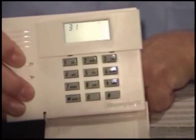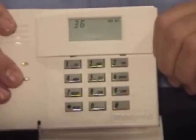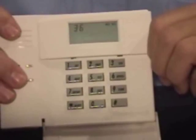We see that zone number 5 is line 35, so we hit star 3, 5. It advances to line 35. Each zone has a different type - the type is how you want the system to behave. Zone 5 is set to zone type 9, which is a fire zone - active 24 hours a day whether the system is armed or not. We want to change that to a motion detector zone, which is number 4, an interior follower. We go back to our keypad displaying 35, which is zone number 5, and enter a 4. That changes the zone type from a 9 (fire) to a 4 (interior follower), ideal for a motion detector.